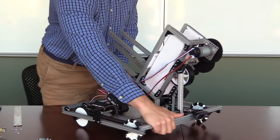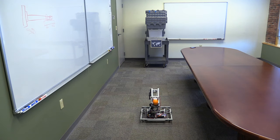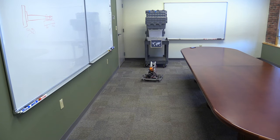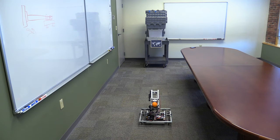This completes the hardware build for the assembly. Next, you will see some video of the autonomous behavior and a discussion of the code. Here's a video of what the robot can do. We can first initiate the active shooter wheel by pressing X on the control panel. We'll notice that we take a shot and that it scores — we'll mark that with B. Then, we'll move forward while still being able to see the target. We can press A to initiate the autonomous mode. The robot will orient itself, move to the right X direction, then look at the target and back up until it reads the right Y direction. Once it's done this, it will adjust its angle one more time if necessary and then begin to shoot autonomously. The robot autonomously makes four additional shots. When we want to terminate the autonomous mode, we hold down the right bumper until the robot stops firing or moving. Then we're back to teleop where we can initiate shooting with X, deactivate with Y, and use the right trigger to shoot.